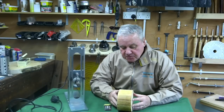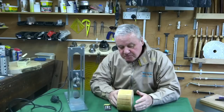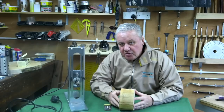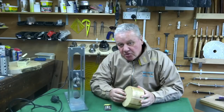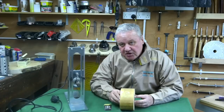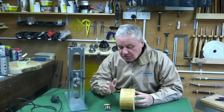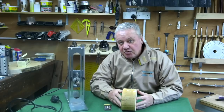So firstly I'm going to complete the outside of the bowl and the base of the bowl as you might normally do. Reverse it in the chuck. Partially hollow out the bowl, leaving a spigot in the centre. Once that partial hollowing is done, you can use the spigot to reverse it again and mount it in the O'Donnell jaws so you've got some firm attachment to the lathe. You can then complete the fluting with the fluting on the opposite side of the chuck, leaving you plenty of room. And when the fluting is complete, you can reverse it again and then remove the spigot.